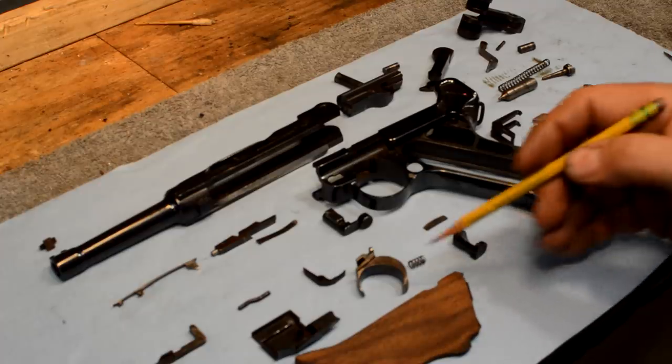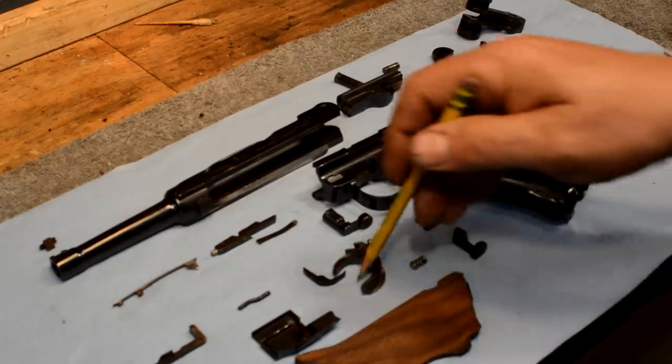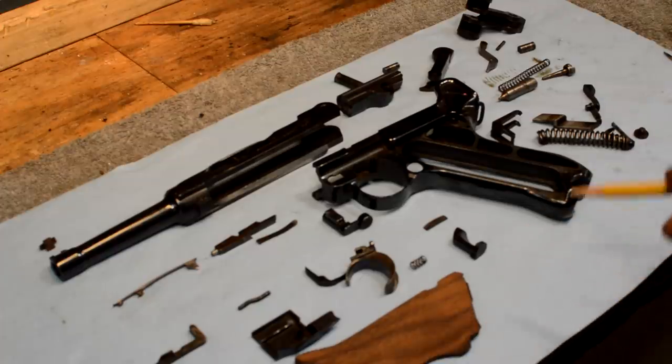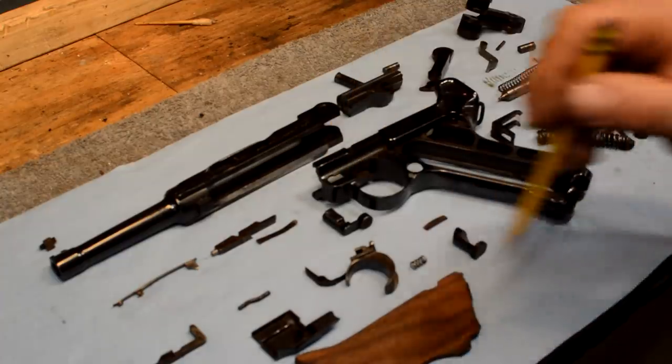The trigger has been cold blued. I don't know what somebody tried to do - tried to match some color, I have no idea. The grips are repop. It's a mutt, but here's the important thing they didn't do with this gun: after you hot dip blue something, whether you polish it or not, you've got to kill the action of the salts - it's got to be neutralized.